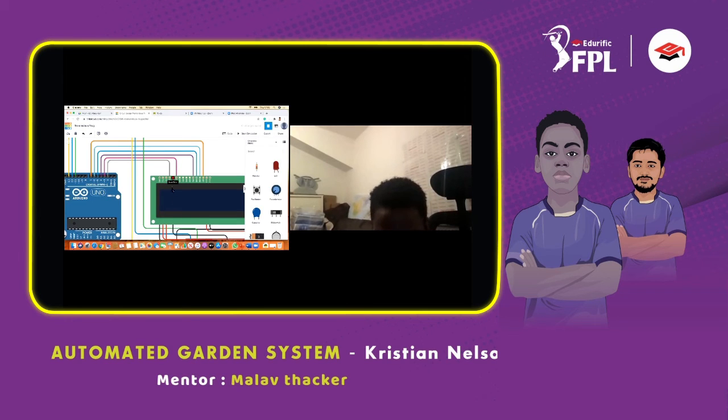Then this is read and write. That is connected to a black wire. And the enable pin is connected to 3. But also the black wires are connected to what is negative. So the ground pin is negative. And also these two are both positive because red wires connect to the positive pins on the LCD. And then I don't think these have a wire. So then we go to these ones.